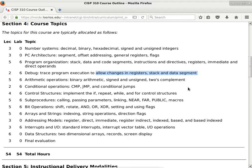Yeah, but that's good. In this class, remember how we started off? We started off with transistors, right? And we stayed on transistors for a little bit until we got to NAND 2 gates, and then we said, okay, with a NAND 2 gate, we can do everything else. But after that, I don't really mention transistors anymore. Once we get to the basic logic gates, we pile up bigger things, the infamous adder and subtractor. We talk about flip-flops and latches and stuff like that. But once we understand the mechanism of those things, I don't go back and re-explain everything from the transistor level up, because I'm assuming that we can just go down one level, drop another level, and another level, and then we get that.